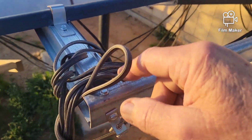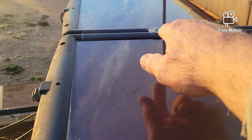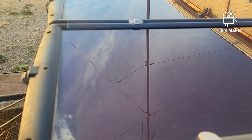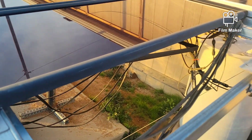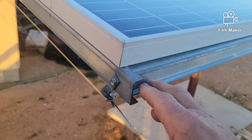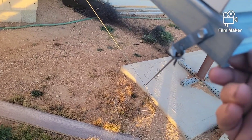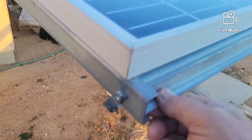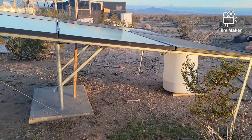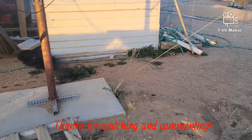The metal setup works out great. I had metal brackets for hold-downs, and in between the two panels I use a longer self-drilling self-tapping screw with a large fender washer to hold them down — works great. Because of the high winds here, I put extra cables on to help hold these things so that when the wind blows they rock but they don't go anywhere.